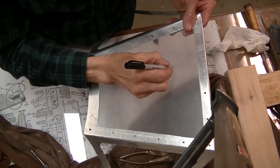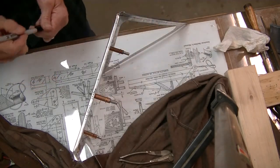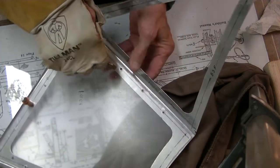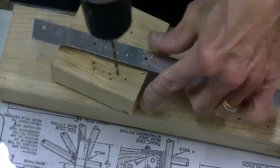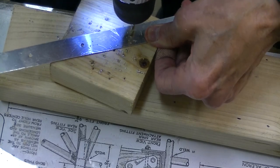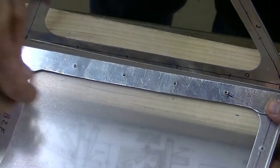Be sure and keep the plastic sheeting on both sides of the plexiglass during this whole operation. It doesn't hurt to chamfer your holes just a little bit, just out of an abundance of workmanship and pride in what you're doing. And we drill and then deburr all of our small backer pieces. We're going to have backplates on all of these windshields instead of a million washers that kind of look unsightly and unworkmanlike. Here we kind of get an idea of how our backplates will come into play.